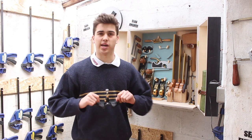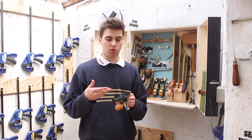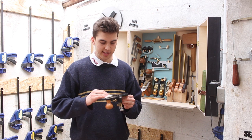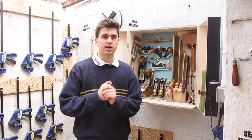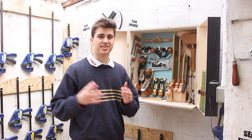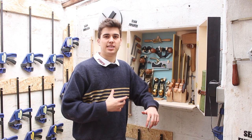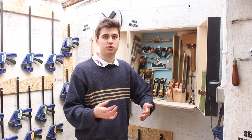The reason I rub off the oil is because I don't want spare residue sitting on the tool that might get onto the wood or the toolbox. If I left the oil on, the next day I'd just have to rub it off again, so I just rub it off straight away — it still leaves a protective layer. I put jojoba oil on my tools roughly once every other week, which might sound like not a lot, but it's working for me. If you're not using a tool a lot, you don't need to oil it as often. A shoulder plane I don't use that often can go a month without oiling because that last coat is still lasting.